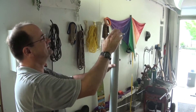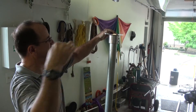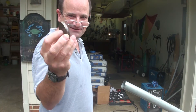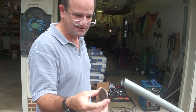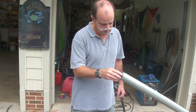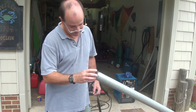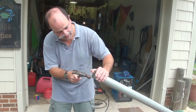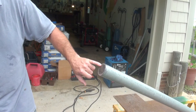And then that goes in here with the set screws. Later in the project we'll show how the long pipes run along this with the U-bolts going through to that. So there's the little disc that we cut out. That's 3/16ths - I started with quarter inch and dropped down to 3/16ths because it was easier to cut. And then there's just a little bit of a taper on that to try to get it to wedge in. We'll set that there and try to find a way that it fits in nice, then tap that in. You can see it's wedged in there. It's not quite round, so there's some gap there that we'll fill in with a weld bead.